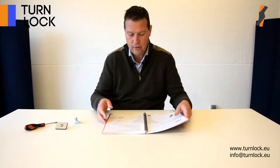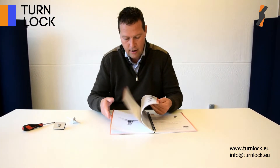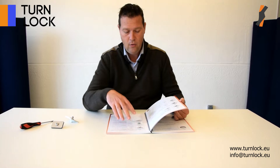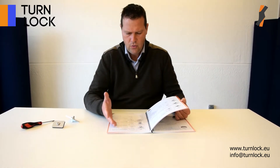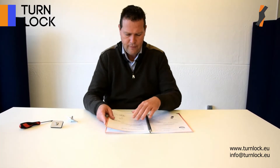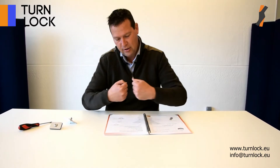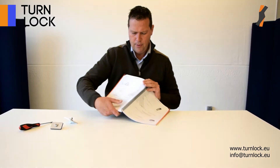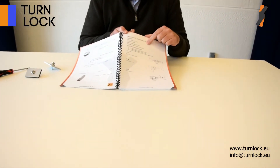Typically, most customers start by looking at the receptacles, because the receptacle will determine which series you use. Another factor is whether you need a light duty, heavy duty, or medium duty series. You can see the strength ratings at the beginning of each series — for instance, 1000 Newton, which is 100 kilograms, indicating how much tension that quarter turn can take. One of the most popular series is the medium duty series.